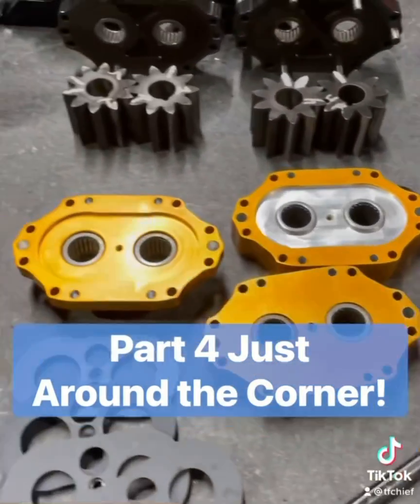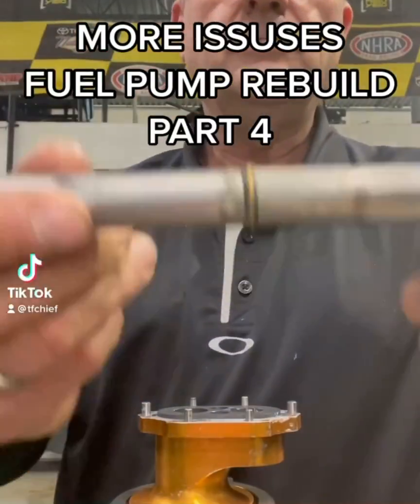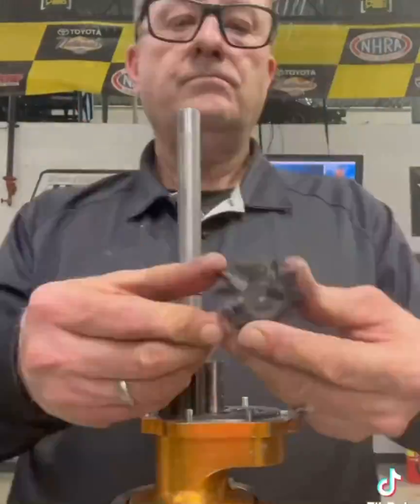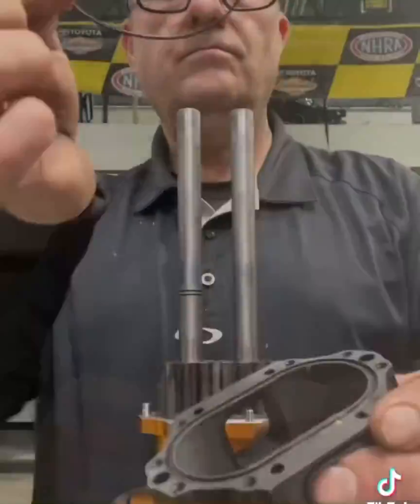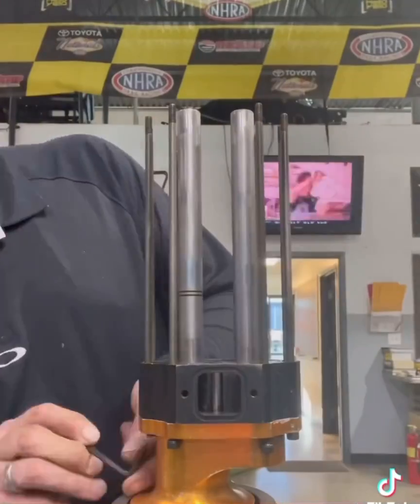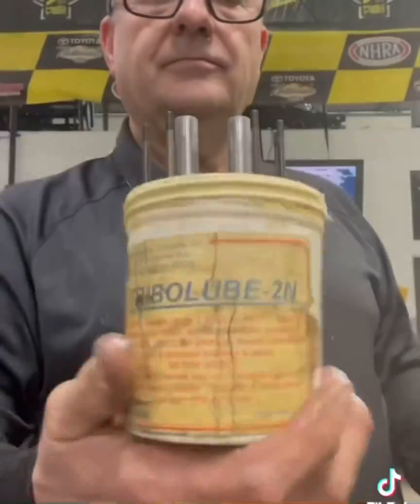Everything's measured up. We'll start sticking this thing together tomorrow. Tonight, I went back to work on this pump and found that the shaft wasn't equipped with the circlips it's supposed to have to retain it in the housing. I replaced all the bearings and the seals. Pretty much all the bearing housings were kind of a train wreck also. So I begin the build process.